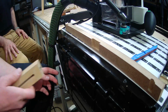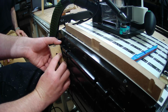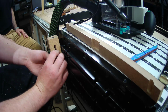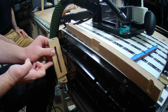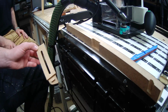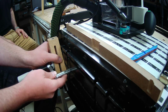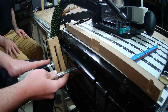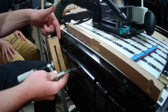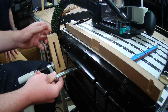It's listed down below, but I actually think we both decided the best way to do it was to just feel it out. Make sure that it is flush with your top and at the right angle. Tighten that down, and clamp just like that. I ended up using the Festool sliding F-style clamps for this application just because they put a little bit more direct pressure in there, and it's kind of a narrow piece. At that point, you can make a grid directly off of the top here, place the file that comes with the project, and install your threaded inserts.